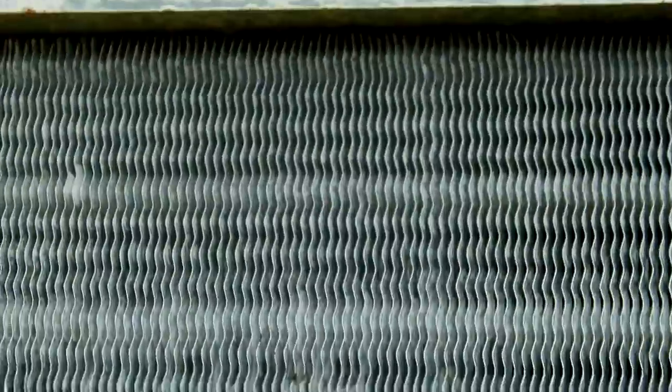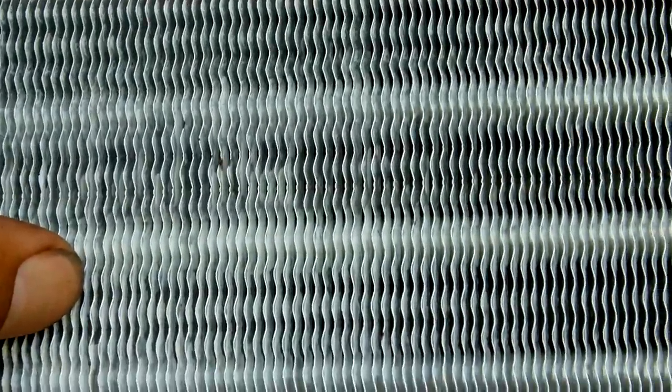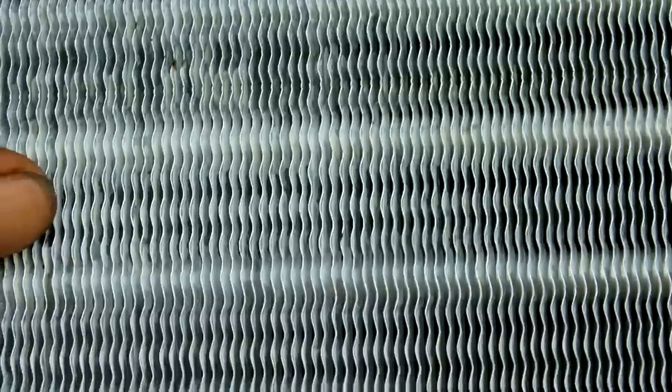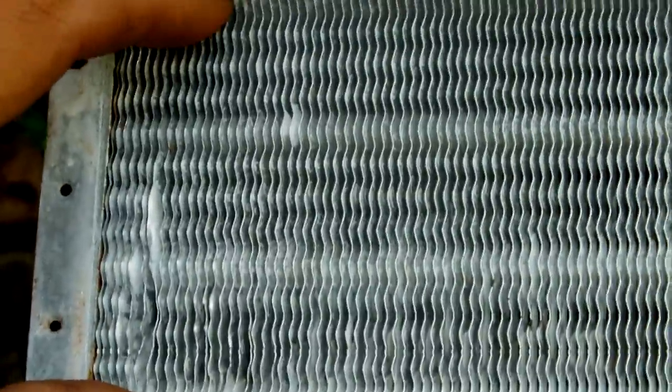Now, if it comes all the way up to here, this thing's big. It goes around, around. So then up here it changes state to vapor, right? From liquid, changes to vapor, low pressure gas. I think that's the right name, low pressure vapor. Outside, that would give me a reading of superheat. Why? Because from here is where everything happens. It changes state from liquid to low pressure vapor, all right?